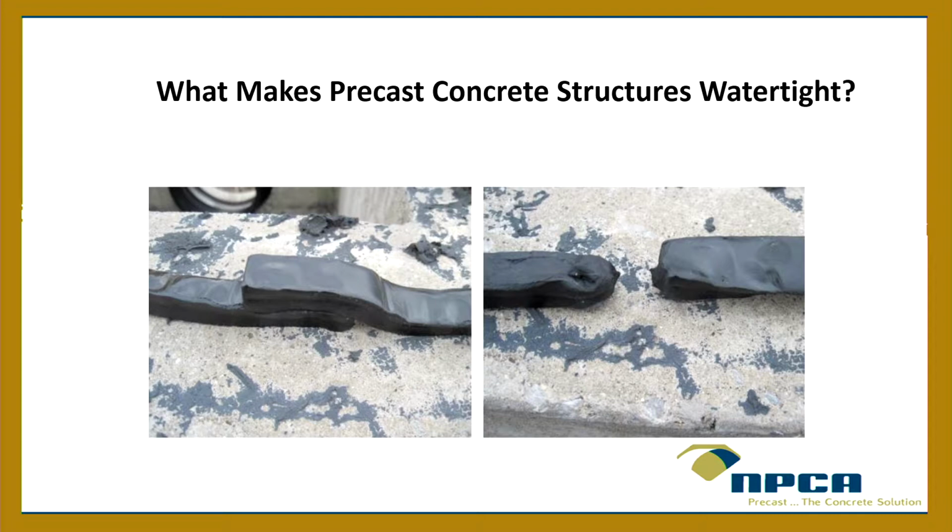Now, the thing about a vacuum test, remember I talked about vacuum testing earlier, there's a lot of force in that vacuum test, even if you're just doing a water tightness test. It'll suck that lid or that top section down even more, to the point where if you're using a quality sealant, you could turn around and pick up that tank by its lid. I mean, if it's a top seam, that sealant is that strong. We were just talking about that situation out on the exhibit floor, where they were trying to take a lid off, and they couldn't get it off. They pulled, and it finally came off, but you can just imagine, finally the bottom came off, and the truck almost tipped over. But yeah, that sealant will really grab onto it.